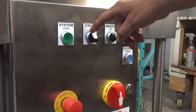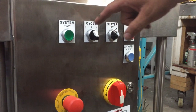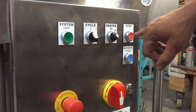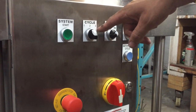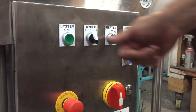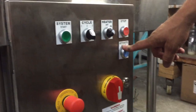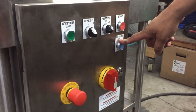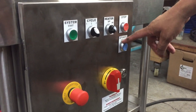Then you switch to cycle two, push the stop button, and it'll drain the soap water and refill with the sanitizer on step two. When you're done, you hit the stop button, drain that water, and go to step three which is the hot booster rinse cycle. There's also a completely separate automatic cycle that does the soap wash, sanitizer, and hot rinse all as one step — useful if you only have one tray to do.